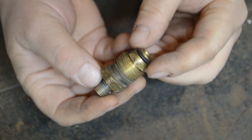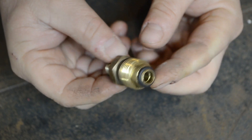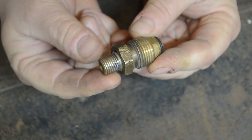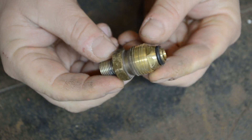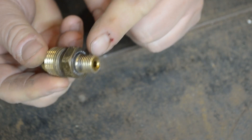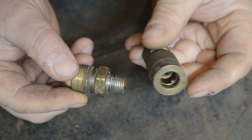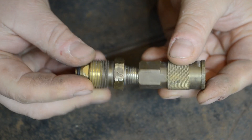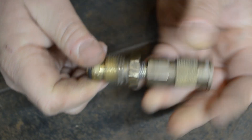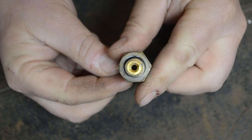These adapters are really easy to find. If you find a gas grill someone's thrown out on the end of their driveway getting ready to be scrapped, just go up, snap this little thing off, and take off the regulator — we don't want that. Then all you need, because it's conveniently tapped with quarter pipe thread, is a quick disconnect air adapter. That screws right on there. Put a little tape or a little plumber's putty on there and you're good to go.